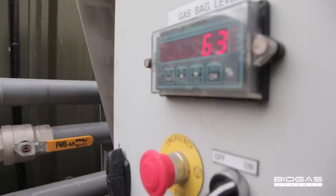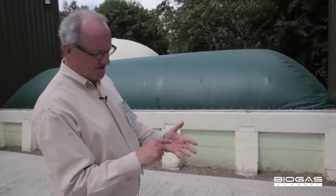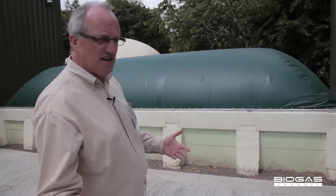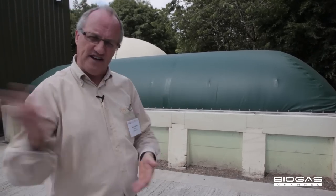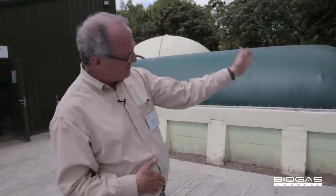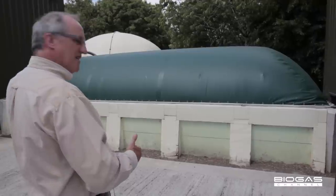we're able to have this sort of feed mechanism because what we have here is two novel concepts. The first is the fact that it's below ground, which is unusual in the AD world at the moment. And the second one is it's a plug flow. Rather than being a cylindrical tank where everything is mixed up and you're feeding in and taking out, this plant here is a plug flow. So the feedstock comes in at that end, and it flows gently down through the digester